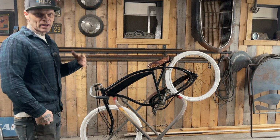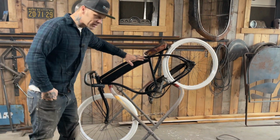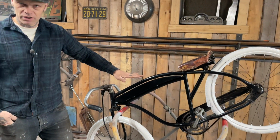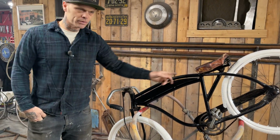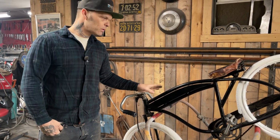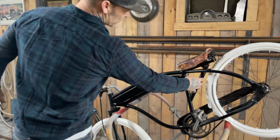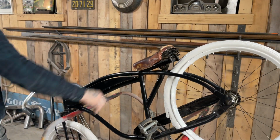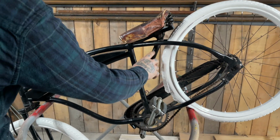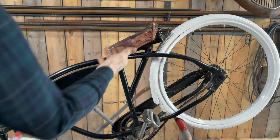But today, we're back on the bicycle. I can't help it. What I have done here, you watched me make the tank, if I can recall. All I did is weld the tank up and grind it off. I flapper wheeled it, and I didn't mud it or prime it. I just ground it off with a flapper wheel, and I spray bombed it. That's all I did. The bar here we put in for the seat tube was cut off. I put a bar up and through here. I didn't go on the front side of the fender, I went on the back side. I wanted to haul the seat back a little bit further. So now the seat drops down in this bar, and that's where it sits.